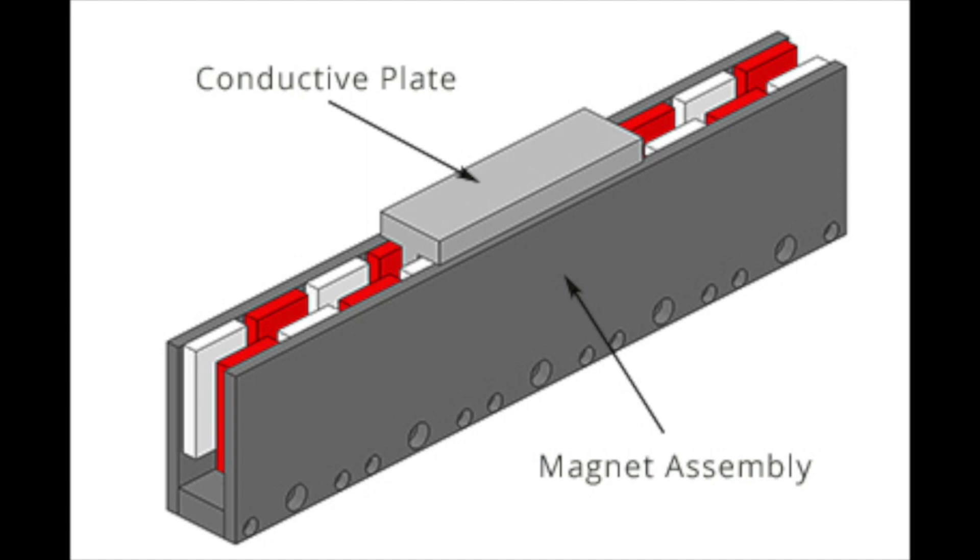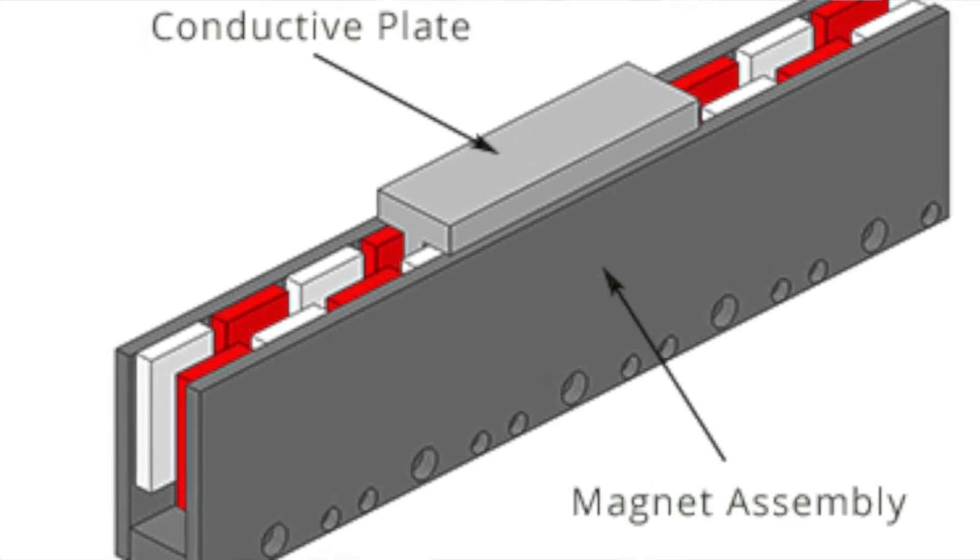Let's talk a little bit about construction. There are two main components to a magnetic brake: the magnet itself, which is a neodymium magnet. They are the strongest magnets pretty much on Earth, so they have the most attraction. A brake is lined with these, and they're about three inches tall, two and a half inches wide, and about an inch thick — so extremely powerful. Inside the shoe, there is a north-facing magnet and a south-facing magnet lined up with each other for the maximum amount of pulling between the two.